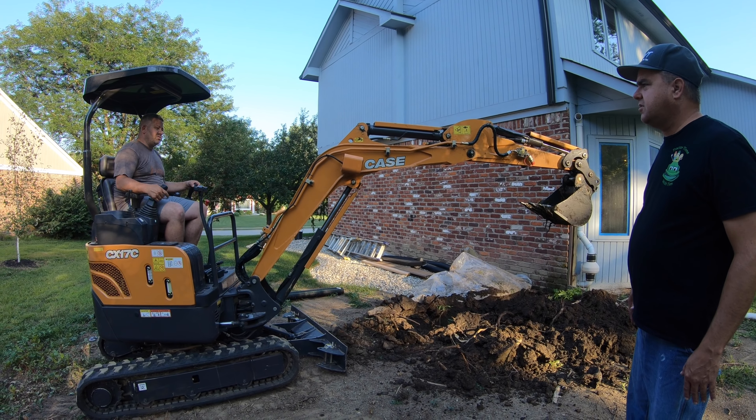I think Jimmy's nervous that we're standing right here and he might whack us. He doesn't look very nervous. That's pretty good. What you have to look at is the bottom of the trench and make sure it's always going down. It still should be able to go down and yet get closer to the surface — that's the whole point of slope. These roots are from a stump we pulled out right in here. If you remember our earlier video, this was where Bob had a fence with big bushes. Jimmy had cut off the big bushes but the stumps were still here — except for the one that fell on you and Casey. Safety first.